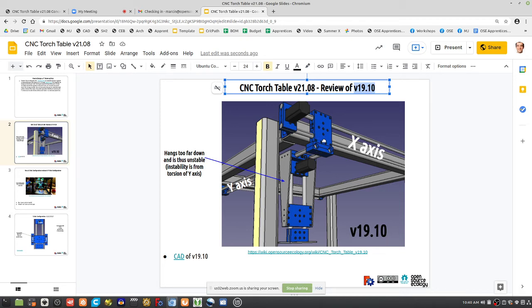and now moving forward, like you see here in this picture, we still have the two clamshell design, where two axis pieces clamshell around the shafts and are connected with bolts, but now we're simplifying it just like we have with universal and pro on the 8mm axis to monolithic pieces, which means that you avoid all those bolts to clamp things together, so you reduce part count and simplify the design altogether.